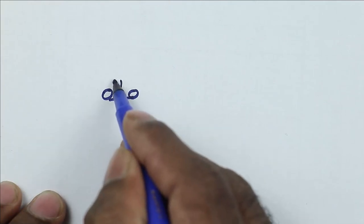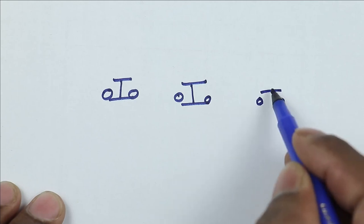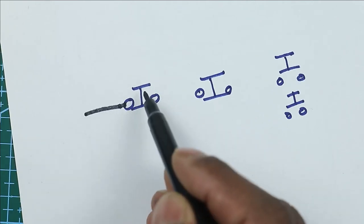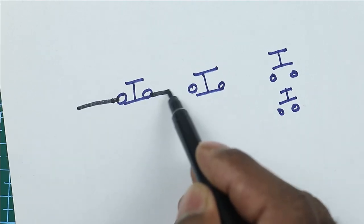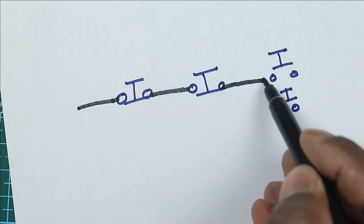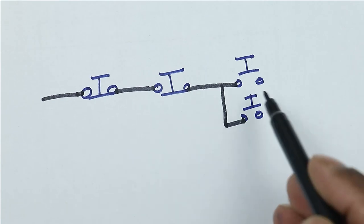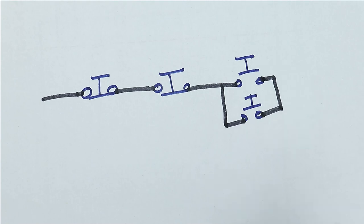In total, we have two stop push buttons, so I am symbolizing two stop push buttons here. After this, we have two start push buttons. For the wiring, the phase supply will come to the stop push button first — provide power supply to the first stop push button, then power supply moves to the second stop push button. The power supply from here will go to the input terminal of the start push button. From this point, loop a wire and provide input power supply to the second start push button. The output terminals are left, so let's short these terminals — loop a wire with these terminals.